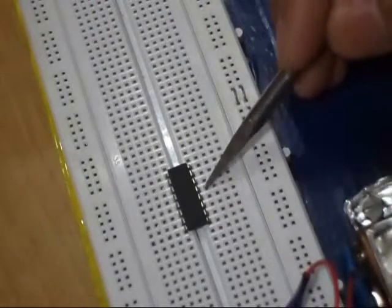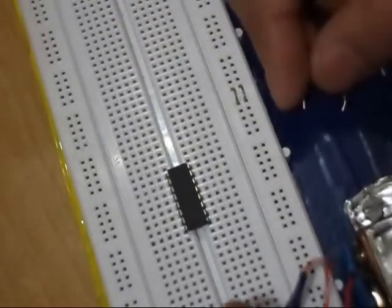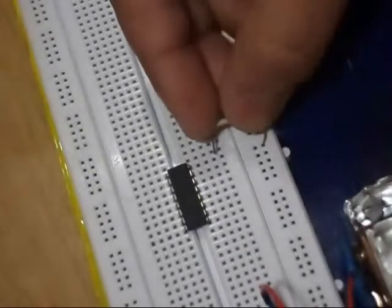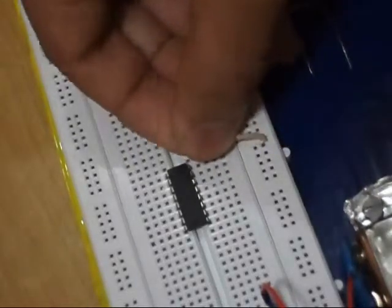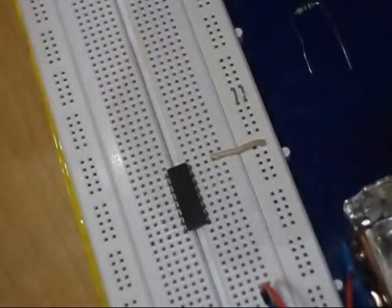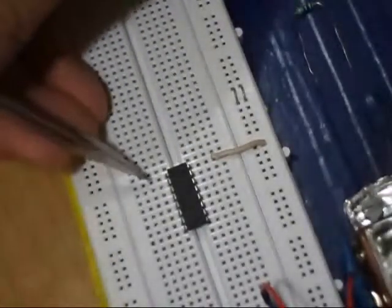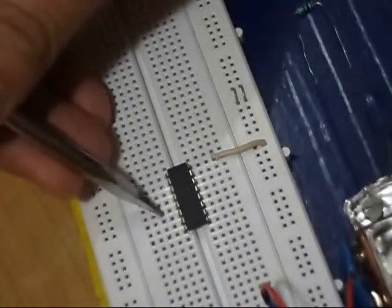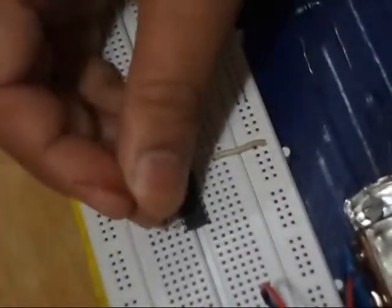Pin 1, 2, 3, 4, 5, 6, 7, 8 — and pin 8 is the ground pin which has to be connected to the negative rail. I am connecting this to the negative rail of my breadboard. Pin number 16 is VCC of this IC and this has to be connected to the positive rail. I am connecting it to the positive rail of this breadboard.